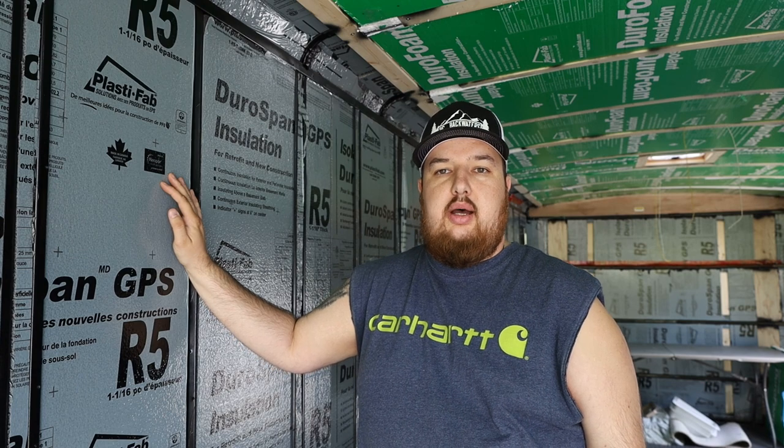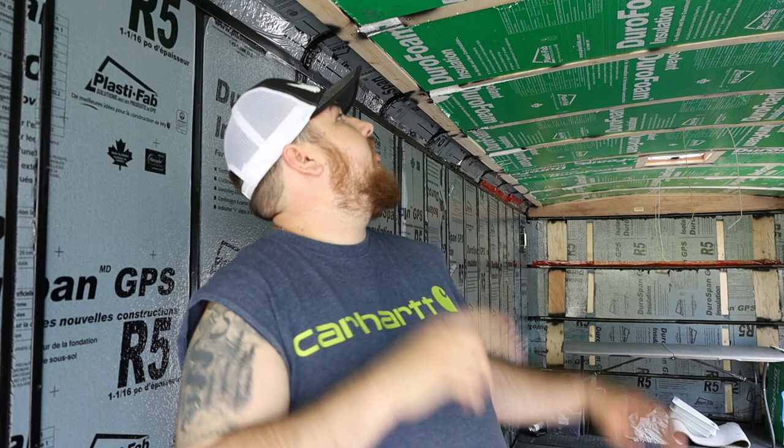Hey everyone, I hope you enjoyed those time-lapses. As you can see, we have the R5 insulation on the walls — it went in really easy, easy to cut, quick measurements, really tight fit. It took me a day and a half to do the trailer. It's eight and a half feet wide, eight feet inside, and just over 24 and a half feet in length. On the roof, we have wood pieces that give us an extra inch up there, so I doubled up the insulation to two inches. The R5 is tight to the roof, and below that is the cheaper R3.75 insulation just to eliminate the gap. That gives me R8.75 on the roof and R5 on the walls. I'm really happy with how it turned out.